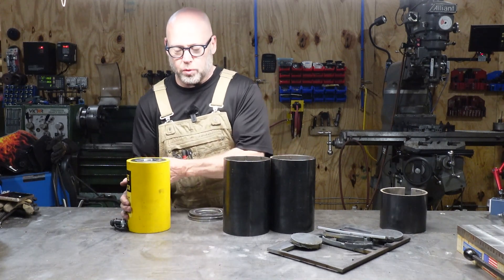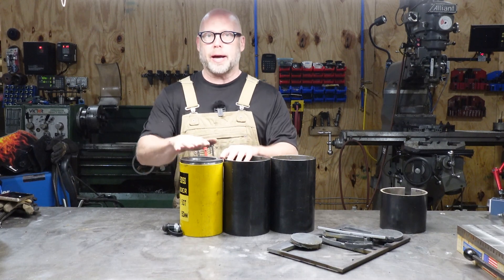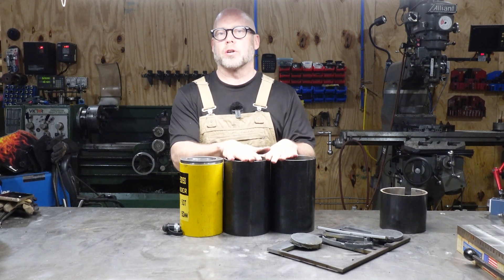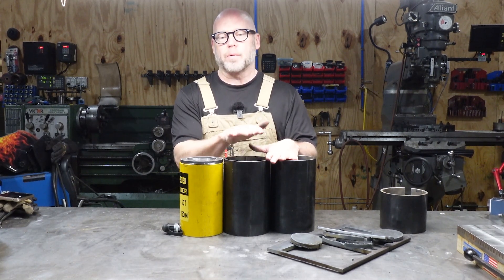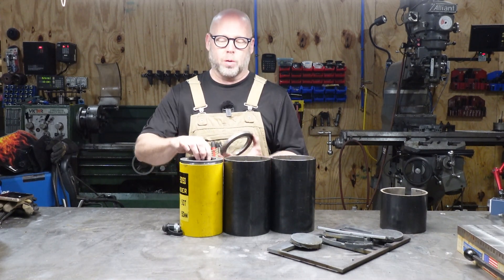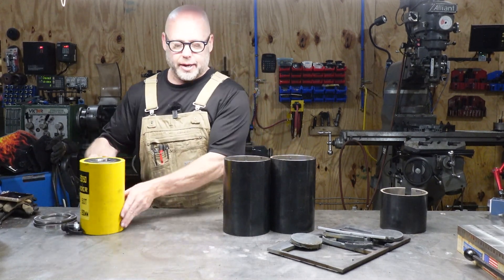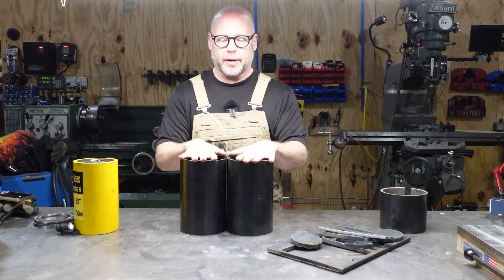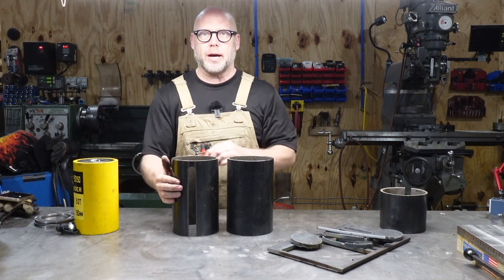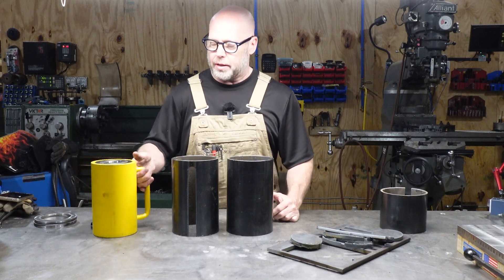That height is equal to the cylinder plus the mounting ring, so when they're inside, the cylinder is a near-perfect fit. I had originally thought about giving the cylinders some room to float in here and nixed that idea — I decided I'm going to make it fit so there's no up and down movement, just one position. We have our two rings cleaned up on the lathe, our two pipes cut to length on the lathe, and on the plasma machine we cut the notch I described in the CAD drawings — that notch is to accommodate the handle.